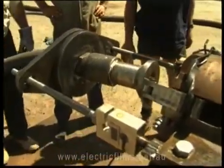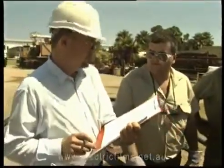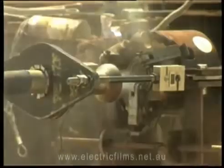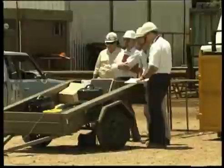The yoke was linked by two load cells to the test rig, and each hose was fitted with a circular plate to capture the force of the hose when it came into contact with the yoke. Using this configuration, the force required to stop the hose at different travel distances could finally be measured with accuracy.